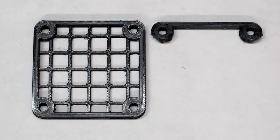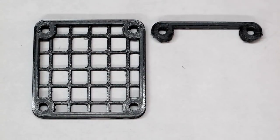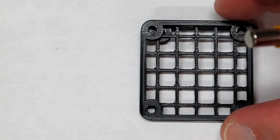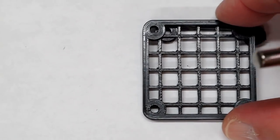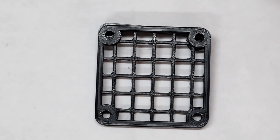The standard thickness for the 40mm cover is about 2.6mm, and I stretch the Z dimension to about 3.5mm to give me the thickness of the spacer I wanted. Then I cut all of this away and it leaves this — my spacer — which goes behind the standard cover so that the cover is parallel to the filament cooling fan.